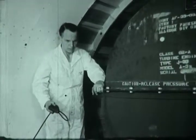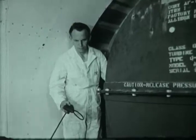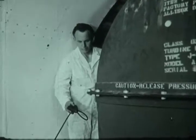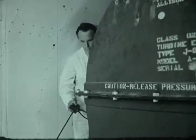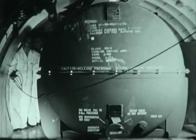A large center of gravity travel in this airplane permits wide latitude in load placement. The cabin floor will take loads of 300 pounds per square foot or 1,000 pounds per running foot. There is no limitation on wheel loads, permitting this heavy cargo to roll easily on its four-wheel dollies developed by Lockheed.